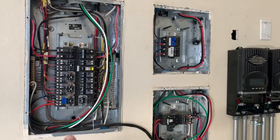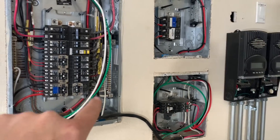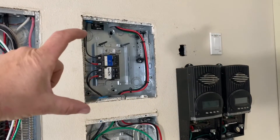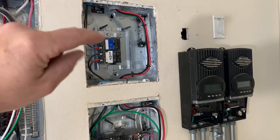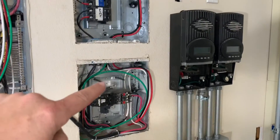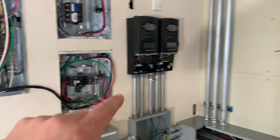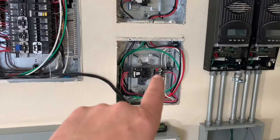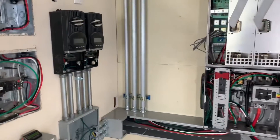I had to feed them because they were three feet short of reaching. Now that I'm a little more seasoned, I really prefer everything being in phase. So we have new wires for our main panel, new wires for the well sub panel — which I used to have kind of like a feeder bypass when we first started, but now we're just going to bail on that; it's just going to be a well control panel. The feed for the generator is coming down, looping through — this is our generator main input panel. Since we removed all the mechanical bypass from what was up here before, we just simply bridged the generator panel into the input of the main panel to get us power for these few days, which has really been working pretty well.